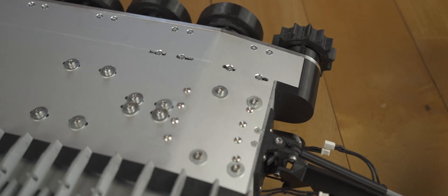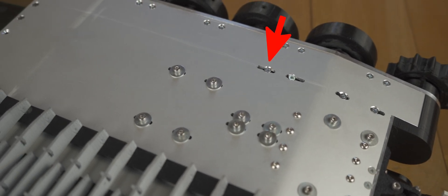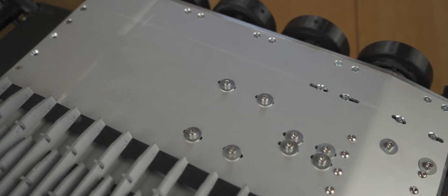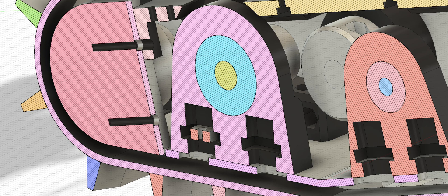When I designed the main aluminium plate I did not realise that the screws meant to adjust the belt tension were hitting the tracks, so I had to countersink them and design another way to adjust them. I designed an aluminium part with a thread to place in the 3D print to still be able to adjust the tension. The print has to be paused and the part has to be placed in the print before the slit gets closed.